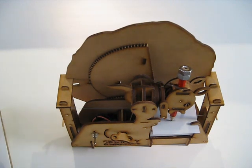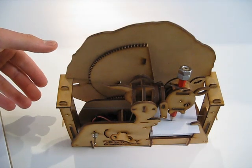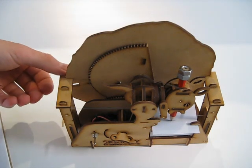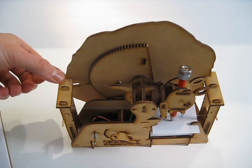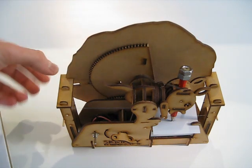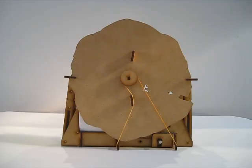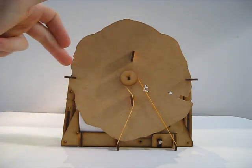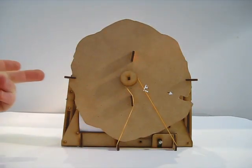I needed a way to control these levers. I could sit here and manually pull the levers to draw pictures, but we need Skrippy to have a memory. So instead, these levers have cam followers attached to them, so that the radial length of the cam will determine how far the lever gets pushed. I got away with having only one cam by having each half of the cam dedicated to controlling each of the two levers.